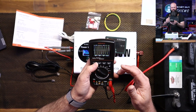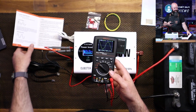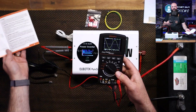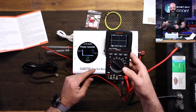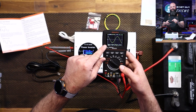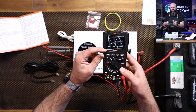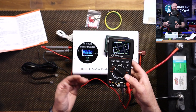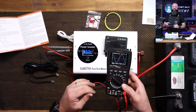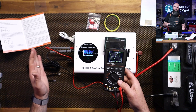That's exactly what we were looking for — a higher-quality inverter with a pure sine wave. Just like they showed in their manual, they are putting out a pure sine wave. It's actually a cleaner sine wave than my own house puts out. One thing I noticed: it starts at zero volts and scales up — it takes about a second and a half to go from zero to 120 volts. That may or may not be good for certain electronics. I'd rather it start up and then turn the output on, so you may want to consider having the output on a switch.